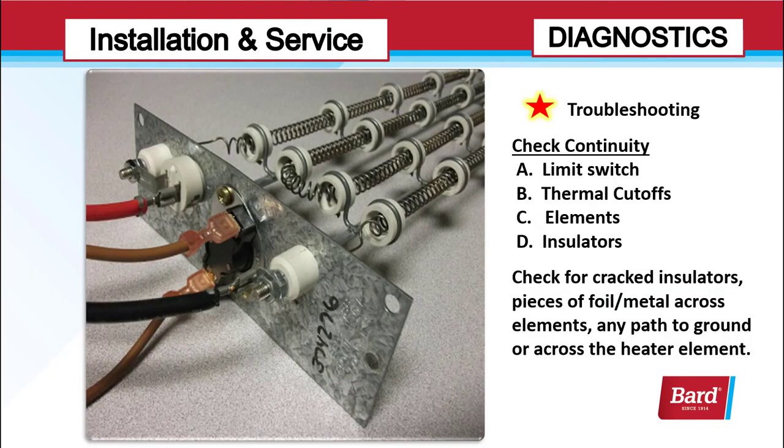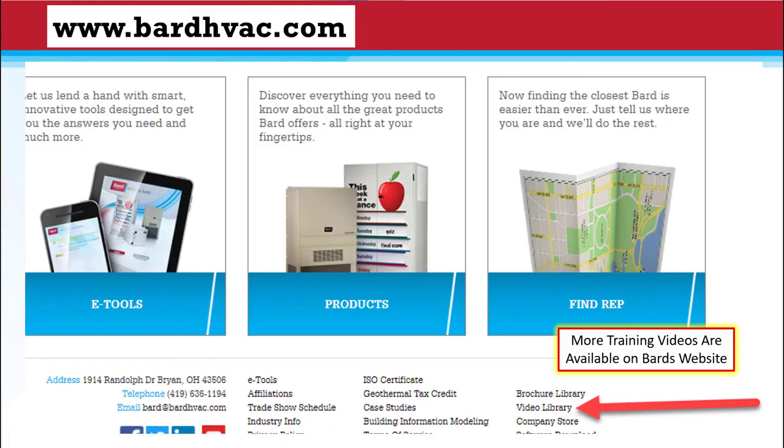When you're troubleshooting this, there are some components that you can replace before you have to replace the whole assembly. The limit switch can be replaced. Thermal cutoff can be replaced. Elements, you're going to replace the whole assembly. If you have cracked insulators on the sheet metal plate, those could be replaced. But if you have cracked insulators on the heating element, you're going to replace the entire assembly.